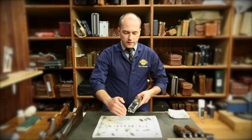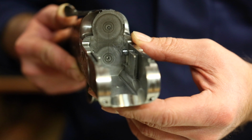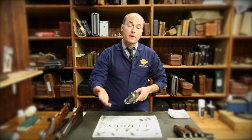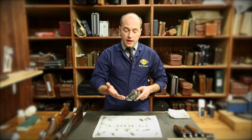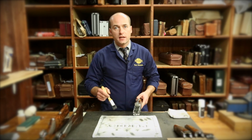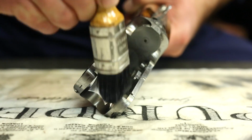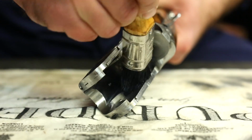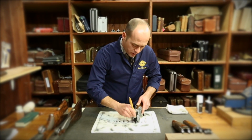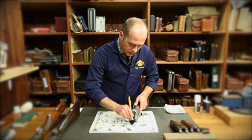As you can see, the area here where the barrels go into the breech is quite exposed, so it can get dirt, etc., coming back out of the barrels from shooting. You can get unburnt powder in there, you can get all kinds of stuff. Again, very similar to cleaning under the lugs in the barrel cleaning video, you want a paintbrush, cut down, quite bristly, quite stiff. And with that, you can actually get into most of the exposed areas down here in the gun.